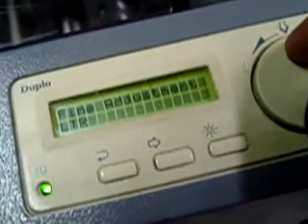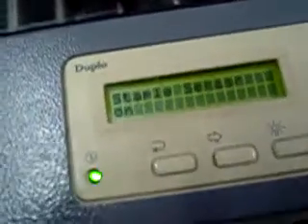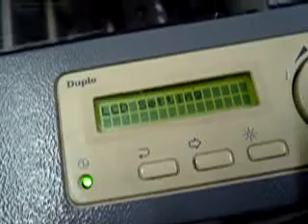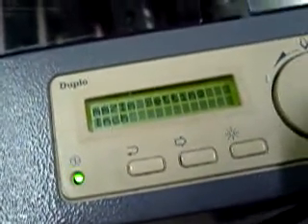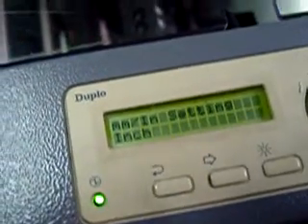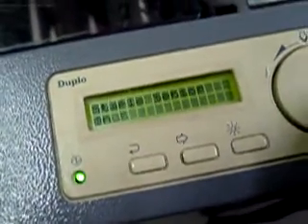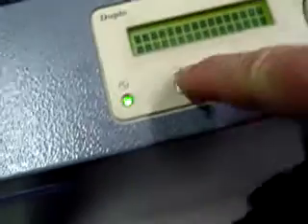Number of sheets — if you were hand feeding, this is what it would do: it would recognize it by sheet. You can input a custom size. Line adjustment — it's going to move a fraction of a millimeter each time, tightening up on the sides and back of the paper. Other settings: staple sensor on, tone on, LCD setting — just how dark the screen is — and millimeter or inch setting. When you're done, it'll say 'bookmaker ready — letter,' which is what we're doing.